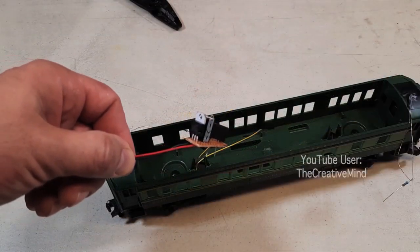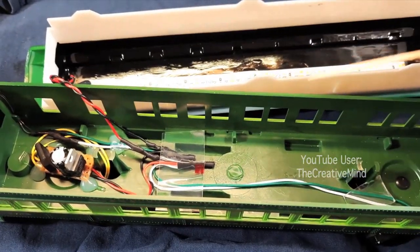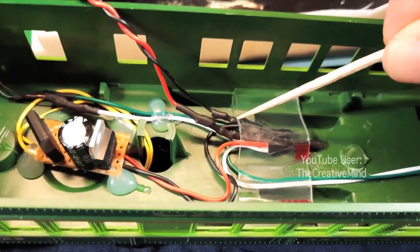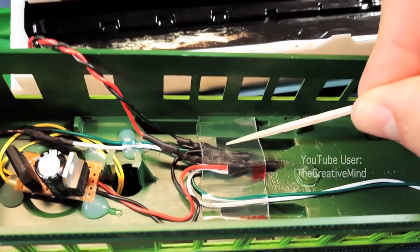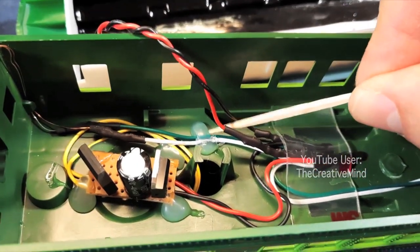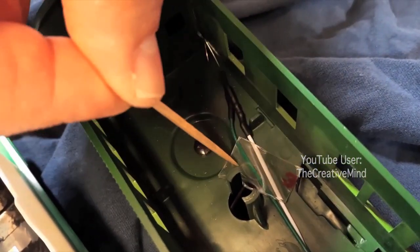I'm going to solder my yellow AC input wires to my rectifier and hot glue the board to the bottom of the passenger car. Once happy with your calculations and LED appearance, put all the wires together. All my wires come together with their resistors and are soldered inside heat shrink tubing. The wires are held on the floor with 3M double-sided permanent adhesive tape, which is very sticky. For the LED hi-hats, I ran wires down the wall of the passenger car, soldered on extension wires, and taped them down to the floor.